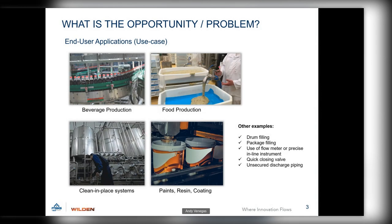There's a handle at the discharge of the pump. When the tote reaches the fill level, a user will close that valve — either a fast-closing or shutoff valve. When they stop it, that pulsation wants to rush back into the pump, creating water hammer — a spike in discharge fluid pressure. This can hit the valve balls and cause damage to them and hose fittings, causing leaks, loose connections, or pushing valve balls back into the pump, causing internal pump damage.